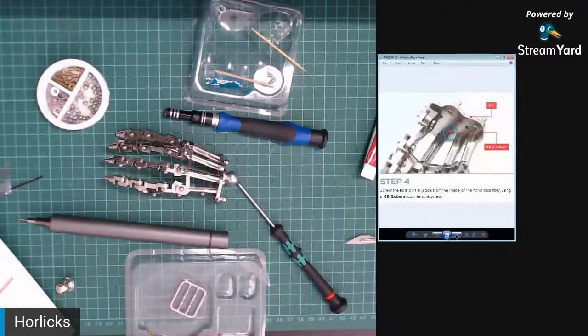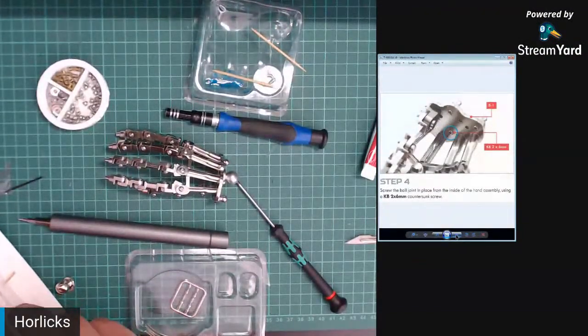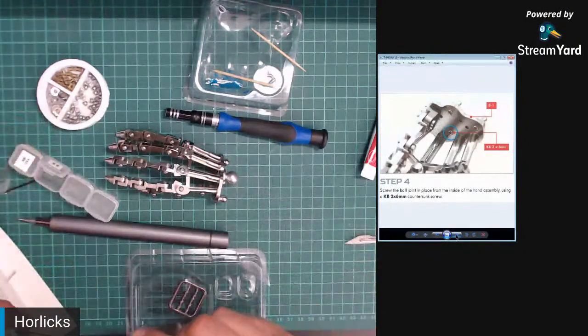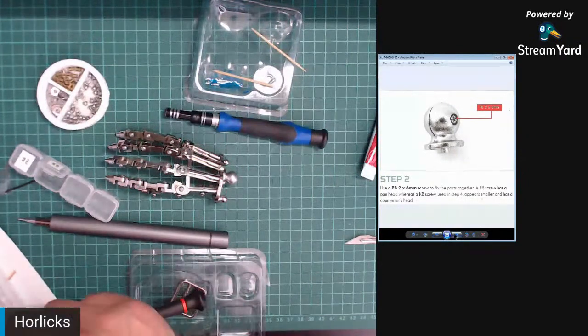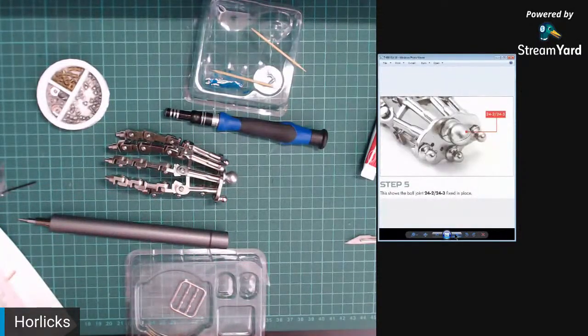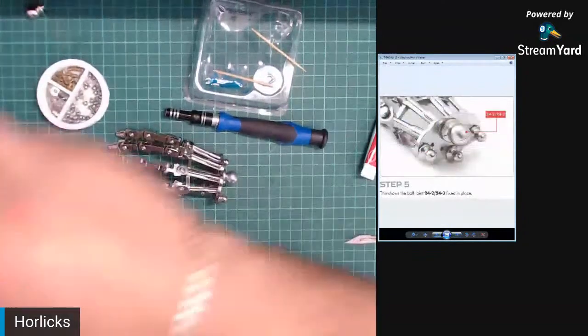Oh no, it's all right. It's over here. So a KB is that? Yeah, that screw you took out of that old ball joint is a KB 2 times 6 mil. If you want to put that screw in the pot, we'll do that. Do you want to know the other screw that was in the joint? Oh yeah, PB 2x6, isn't it? So that's the KB and the PB 2x6. I might as well just leave that ball joint as it is, just in case. Be all right.